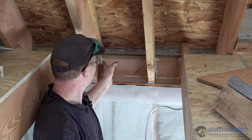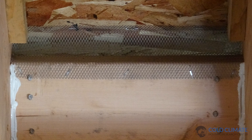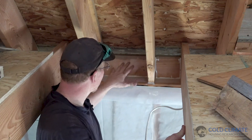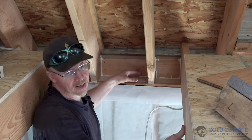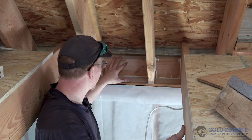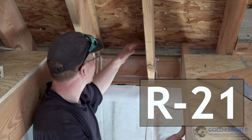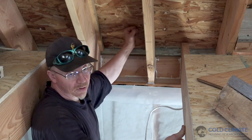There is 2x6 blocking here and there's a vent space — that's good — but that displaces even more room for insulation in this vulnerable area right where the roof meets the walls. Best case, if we were insulating this with fiberglass batts we might get R21 in here, and that's just insufficient for this roof. We're risking a lot of heat loss right through to the roof deck.